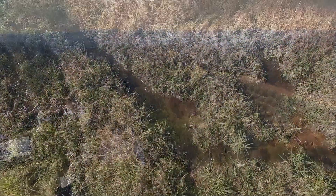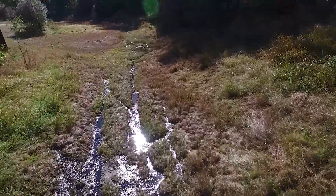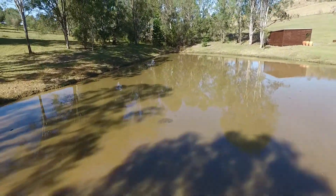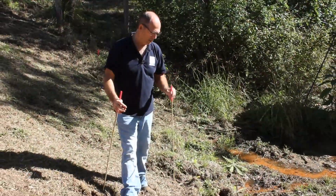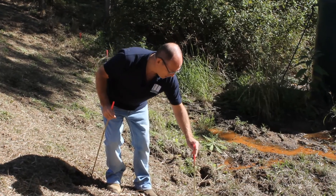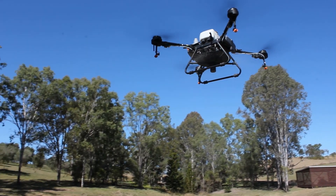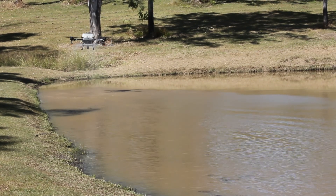This is the bottom of the dam wall. It's totally obvious that there's leakage under the dam wall, and this is probably one of the most common scenarios we see. The way it should be constructed is a big trench through here to get down deep into the natural ground, then bring up layers of clay soil and compact. If you had a dam draining straight down into porous soil, you'd look at treating the whole area of the dam. It's often good to look at a before and after scenario. I've just got a couple of bamboo stakes, and the areas where there are visible signs of water draining away — if I mark those spots, we can come back after treating this area with Dam Sealer and make sure these areas are drying up. If they are drying up, that gives you confidence that you're actually sealing the leaks and water is not pushing in under the dam wall.